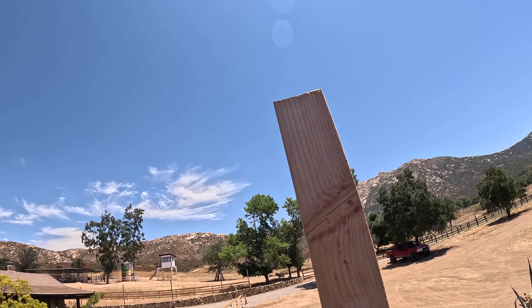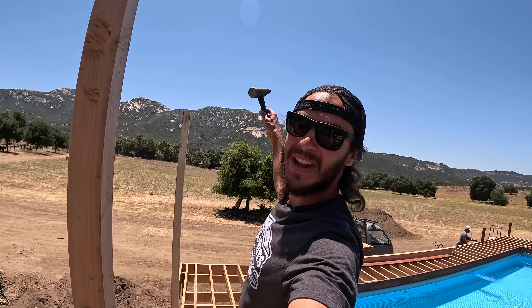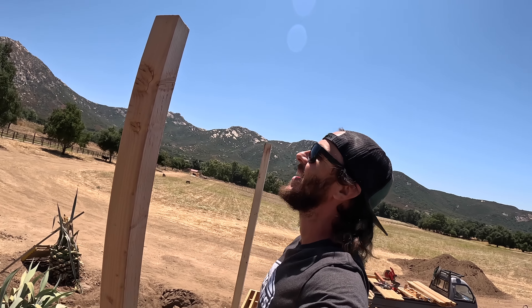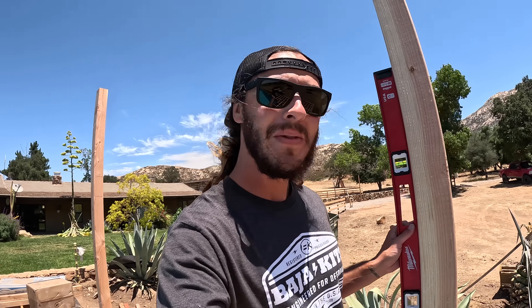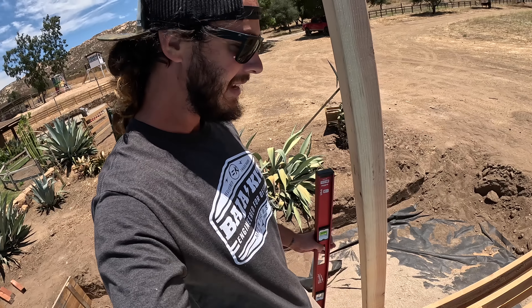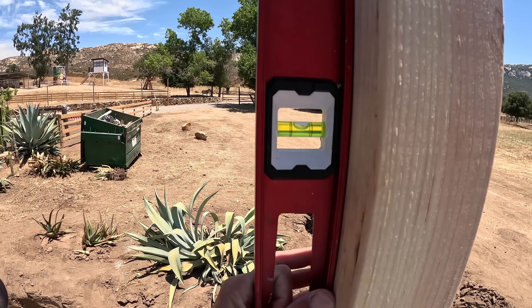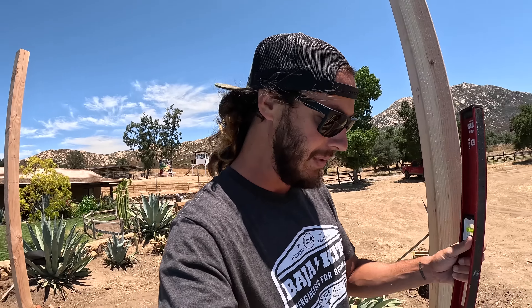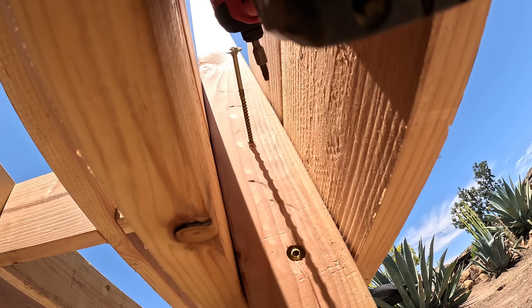We're going to be standing on this little step stool — a little sketchy, a little sketchy, but I've done worse. We're just going to tap her down until we get to eight feet. We should go to nine feet — we only got to come down an inch. I ended up going with eight foot six so I didn't have to pound them another six inches down. One of the benefits of really taking the time to make sure the posts are plumb is it's going to come back to save you. This is literally perfectly mated to the four by down below and it is dang near perfectly plumb. That's important because you can't really adjust it after — you'd have a gap between the four by fours and I want them nice and tight when we screw them in.